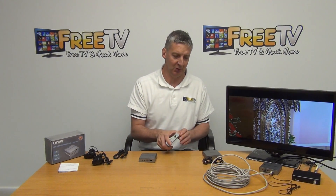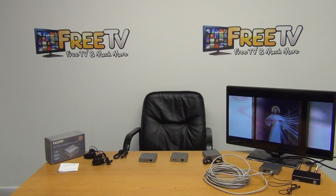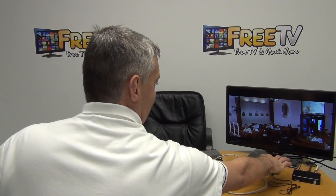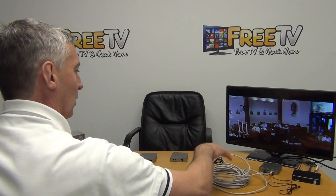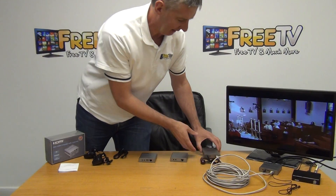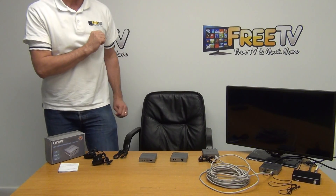Here's a live demonstration of the setup. We have a TV running off a set-top box over a Cat5 cable. The high-definition satellite receiver has an HDMI lead running into the back of the transmitter unit. In normal circumstances you might have another HDMI cable going to a local TV, but here we're running it directly across a Cat5 cable — in this case 20 meters — into the receiver, which then connects to the TV behind us. When disconnected there's no signal; reconnecting it restores the picture.